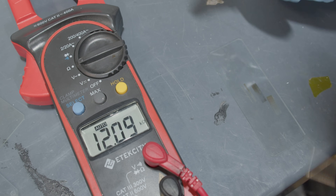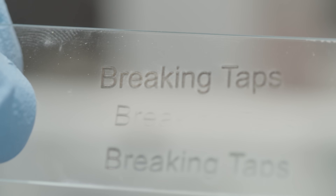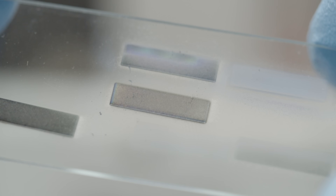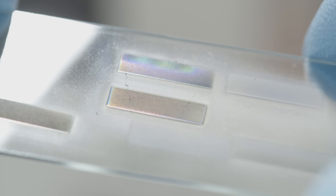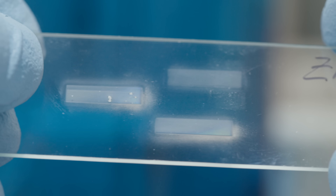One sample did get reasonably low resistance, but it was also the most non-transparent of the batch — so this one was a bit of a bust. I tried titanium, which was pretty fun. Some parameters deposit a nice metal film while other parameters are clearly oxidizing very heavily, giving a rainbowy titanium dioxide film instead. Zirconium I couldn't get to work at all — it always left a bluish zirconium oxide film that was completely non-conductive.